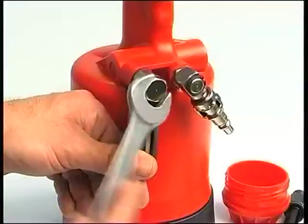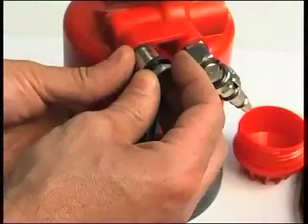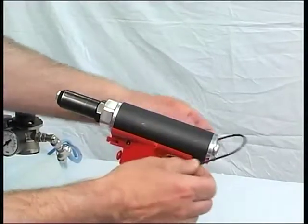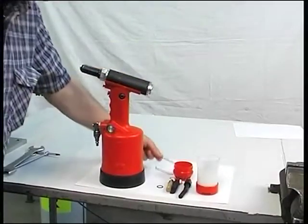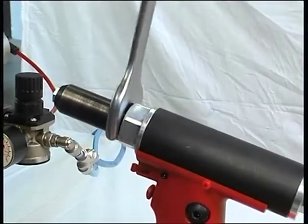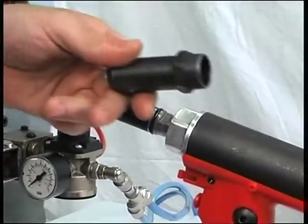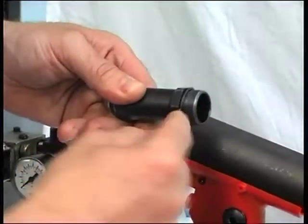Use a 17 mm wrench to unscrew the connector, figure 69. Free the protection and then the silencer. Remove the balancer hook, figure 25. Use a 27 mm wrench to unscrew and remove the head carrying nozzle, figure 2. After that, remove the O-ring, figure 3.